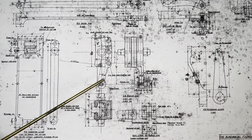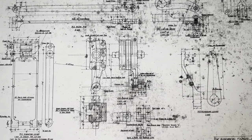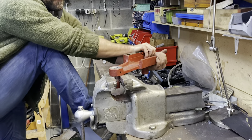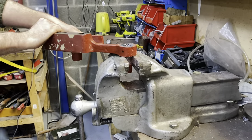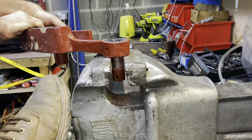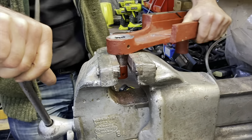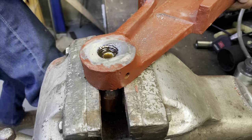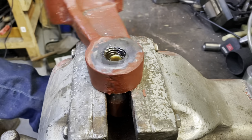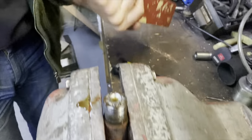This is the Bundaberg expansion link drawing, and you can see the pin there that's driven by the eccentric rod. This is me twisting that pin out — it's actually threaded in, but the pin was rusted and gnarled, so it was simpler to put a new pin in. We did consider skimming it down and making undersized bushes, but it was a relatively small, disposable part, so we decided it was a more coherent solution just to make a new one.